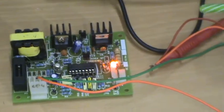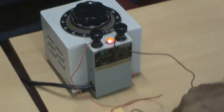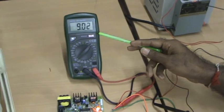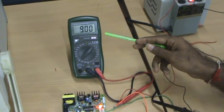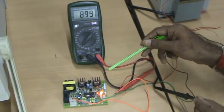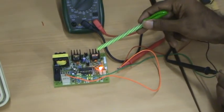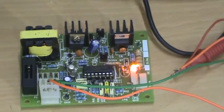Now I am going to give input to my kit from an auto transformer which I have set as 9 volts AC, converted to 9 volts DC. You can observe that in the multimeter 9 volts DC has been given. My input range is from 8 to 12 volts, through which I have to get an output of 15 volts DC, which I can get from this 7815 regulator. I have set 9 volts DC and now I am going to check waveforms in the CRO.